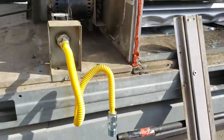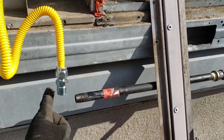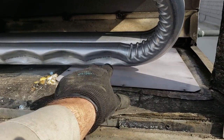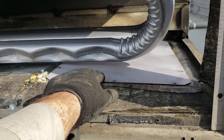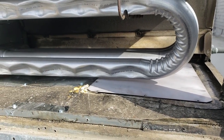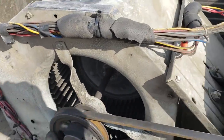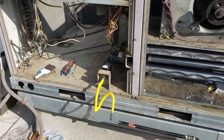Everything's back together. I'm just waiting for another fitting — we redid the gas line and we're going to put a proper sediment trap right there. We put this cover panel on so we can fire up the heater and burn off all the oil. We cleaned the blower assembly out, got down in here and cleaned the drain pan, and that backside you can't normally get to — we cleaned that out too. Just waiting for the other T fitting to finish this up.